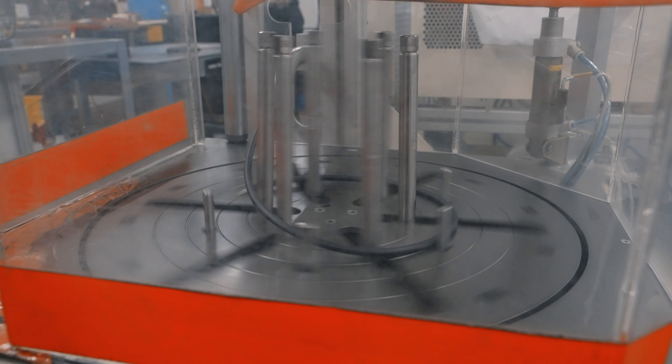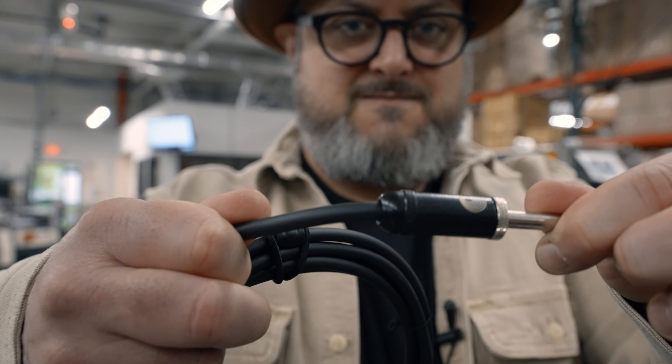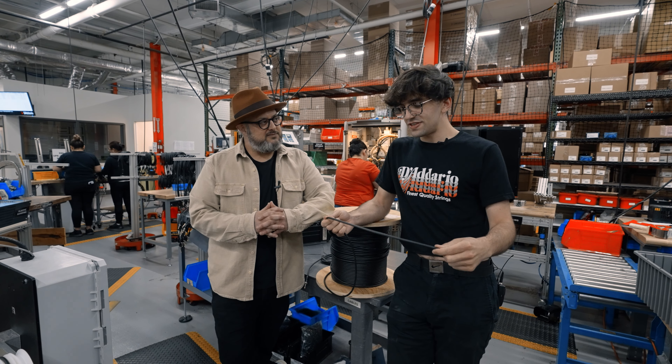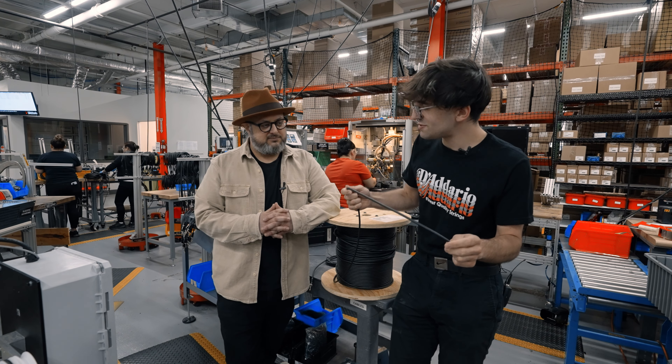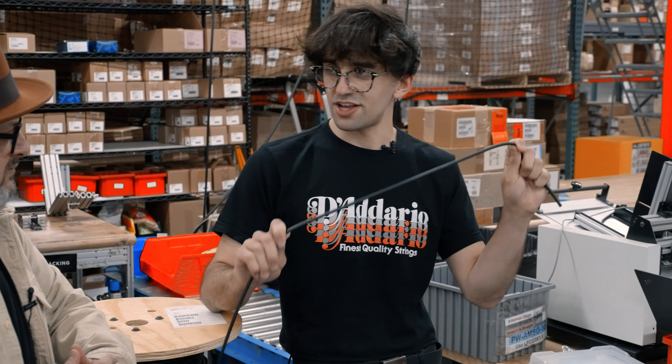They get stripped and cut, coiled, and brought over here where we solder on our geotip ends, which are a special kind of plug that has less of a hard angle, so it wears and tears less on your jacks — your pedals and guitars don't need to go to the doctor as much. This is a cable we developed that is actually 27 picofarads per foot, which means you get as high quality of guitar tone as possible. We tested from zero to 50 picofarads, and found this sounds like a hi-fi guitar that isn't harsh. Too low sounds terrible, too high sounds muffled — this is the perfect amount.